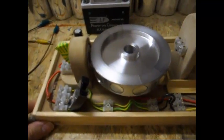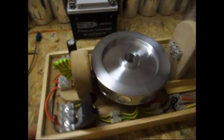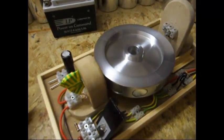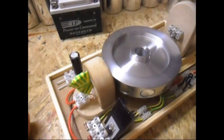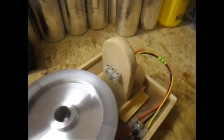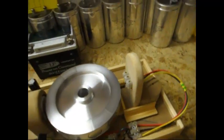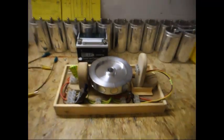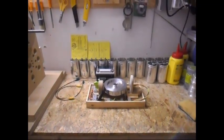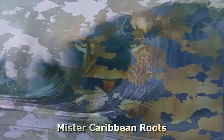That was about it. I think this is the last update on this motor — just playing around with it. As you can see, you can make a Pulse motor with a transistor and trigger coil. A transistor and hall sensor will work the same. N-channel MOSFET and hall sensor, or N-channel MOSFET and a trigger coil — doesn't really matter. Just a small video on this one. Hope you enjoyed it, and thanks for watching. Bye!